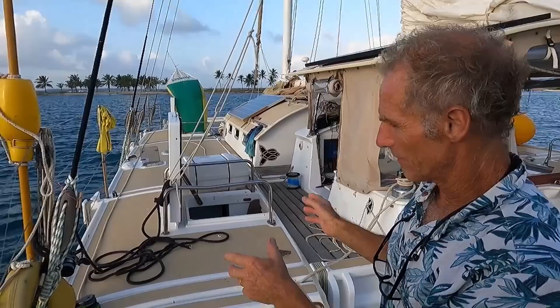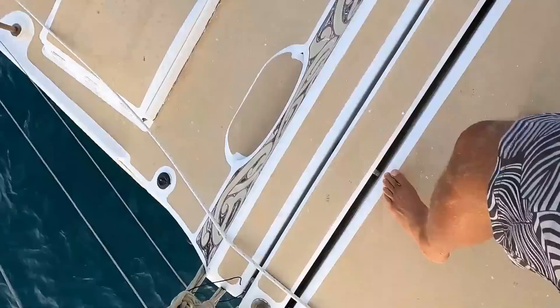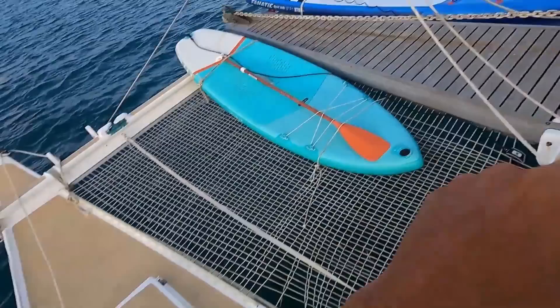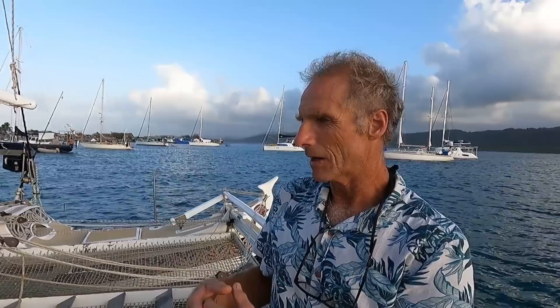The fundamental principle looking down the hull is it's a really long narrow hull, inspired by the Polynesian double voyaging canoes that basically colonized the entire Pacific during the height of the Polynesian era. All of these beams that hold the two canoes together are latched on with lashings, and the idea is it maintains some flexibility in the overall structure. The key thing is that if you've got a bit of flexibility, the hard points where the connections are between the canoes and the cross beams aren't under so much stress or shock loads.